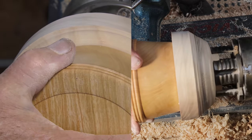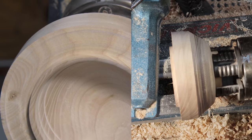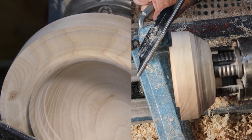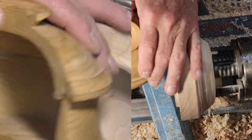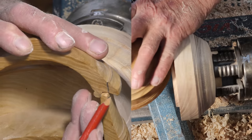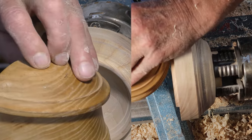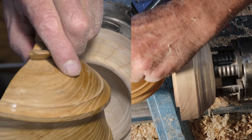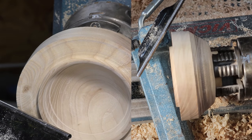And if I can hold the box up there and spin the lid, that's probably just about right. Now, on this slope, I've got two options. When I'm making this, I want it undercut, so that when we're looking at the half box, it's like a little eave on a house, I want it coming down over the wall so that when you look at the box from the side, when it has warped, you won't see the gap where it's warped. So that's the purpose for doing that. Slightly undercut, and I've got two options for that.